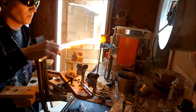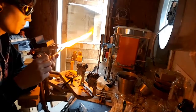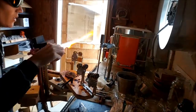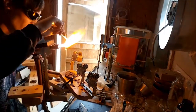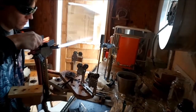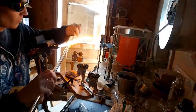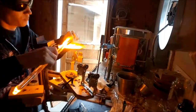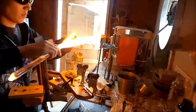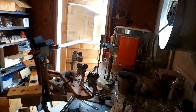If you've ever watched any blacksmithing videos, you'll notice that scale comes off of hot steel as it's being pounded out, and we get a similar thing here. At high temperature, as the steel moves around, the carbon and impurities come off of it — in glass we get bubbles and black chunks of scale. In normal glassworking you avoid bubbles, but here it's unavoidable.